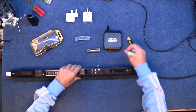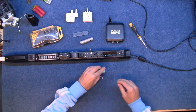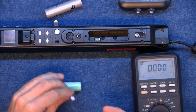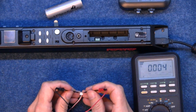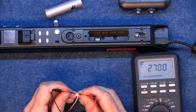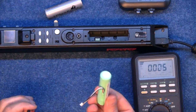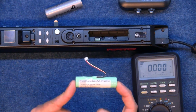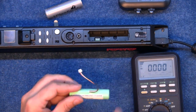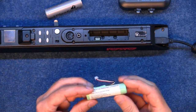Anyway, I'll test this battery and see what voltage is actually on it. I know the battery isn't under load, but you can get a general idea. So there we go — we've got 2.699, basically 2.7 volts. Now because of that this won't even charge the battery up. It decides the battery's faulty and won't attempt to charge it, which I think is a little bit ridiculous. But anyway, enough of that — I'm going to peel this apart and see what I can do.